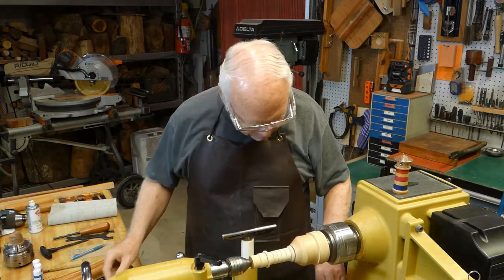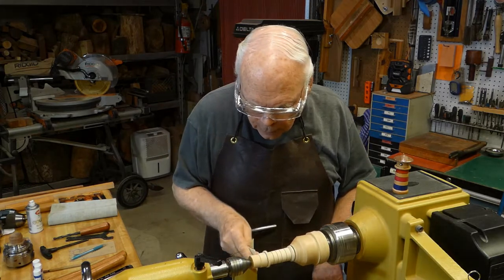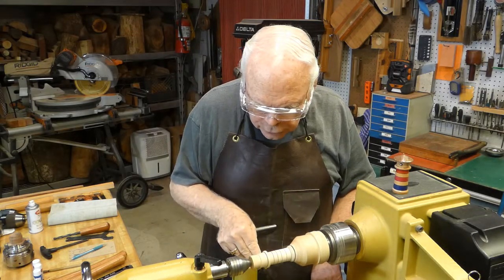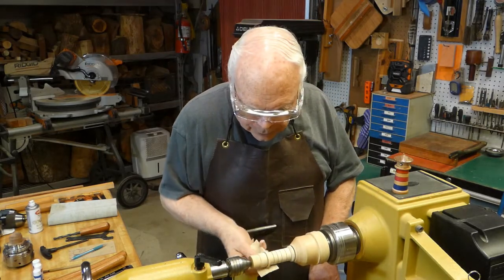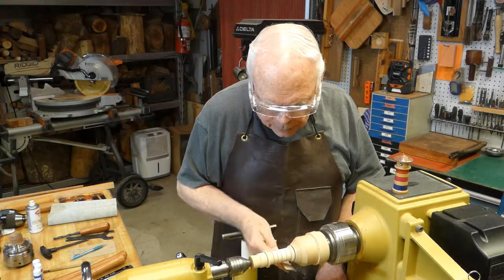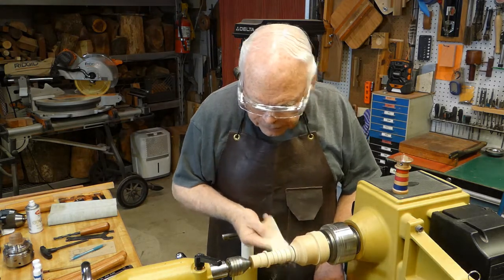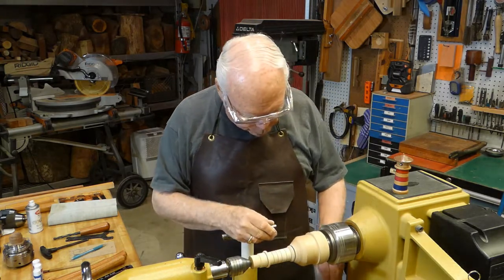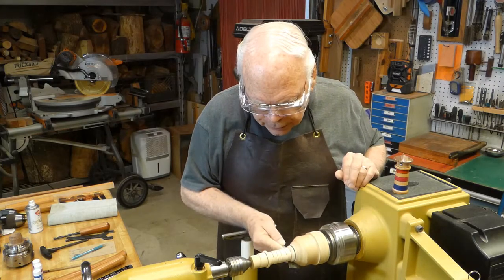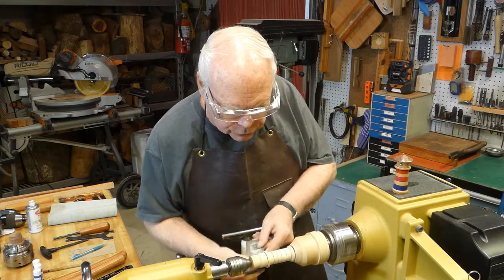Well, that was 180, 220. The reason I drilled the hole first up here was so that if there were any splinters, they could get sanded out at this point. I also burned the lines first before I sanded, because if the burn wire leaves a mark, it shows where it's been burnt. It kind of darkens the wood. This will erase it, get rid of any marks like that. The burn wire mark will still be there because it's down below the surface.